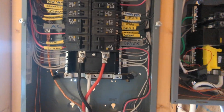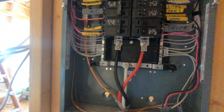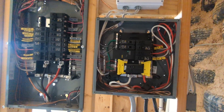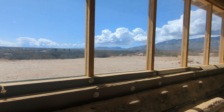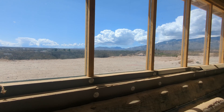Another thing to keep in mind, depending on the inverter, you have a ground-neutral bond at the inverter or in your electrical box. What I did: I kept the ground and neutrals separate — this is the neutrals and this is the ground bar — separate in every box. These two green wires are where the ground and neutrals are connected. If I remove these two green wires, then the ground and the neutrals are disconnected, and you could connect them at the inverter if you had to. It's an elegant way to be flexible. Keep them separate and only connect them in one place — you cannot have a ground-neutral bond in two places, you'll get ground loops and all kinds of other problems.